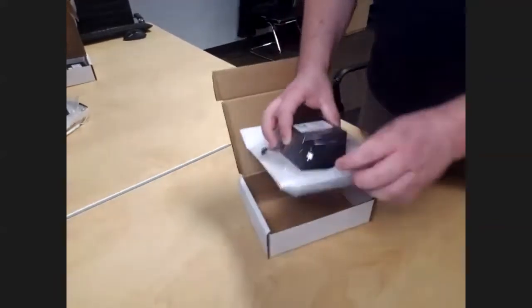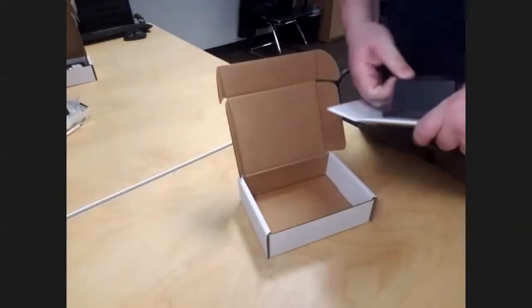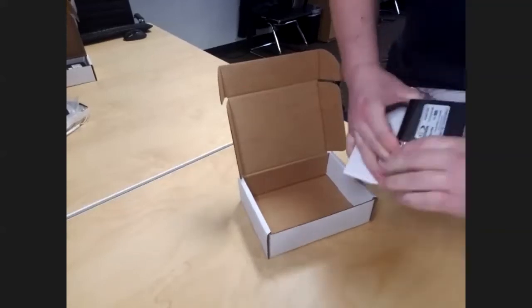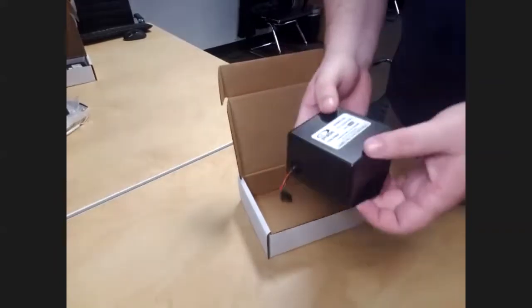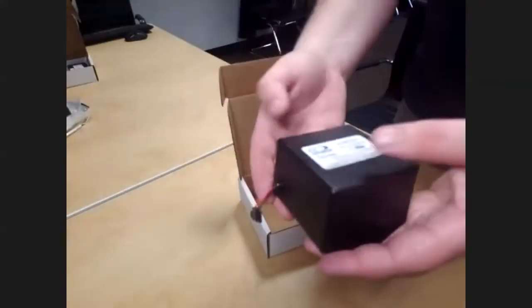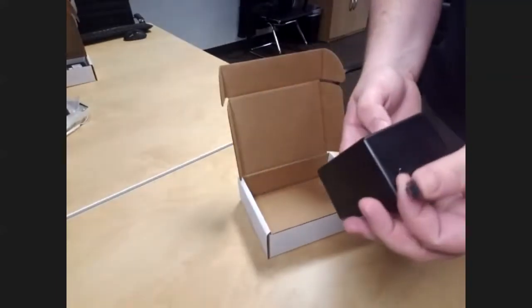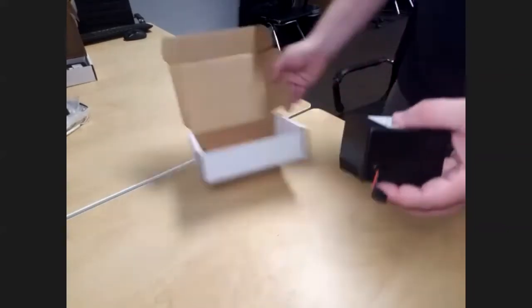And the backup battery is one per display. If you're a home builder, you get to choose whether you want 0, 1, or two or three if you have that many displays. If you're buying a Dynon certified system, you do need to have one per display. They power the SkyView display and then the items that are powered by SkyView networks. So that's the ADAHRS, the engine monitor, the ARINC interface module. What else? I think that's kind of the core component.